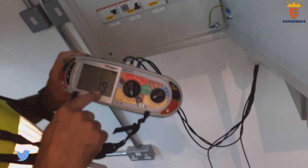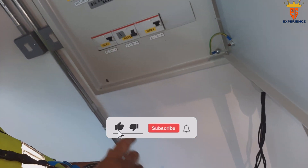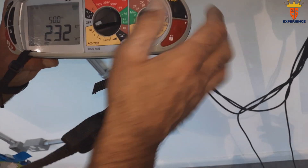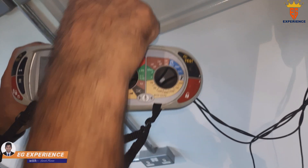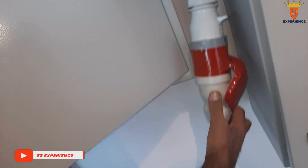This will tell you exactly how many milliamps it trips at. There's also a half test — half of 30 is 15 milliamp. We don't want the RCD to fail at the half-current level. At 15 milliamp it should hold, and it did — that's good. If it tripped at 19mA on the ramp test, the 15mA half test passes fine.